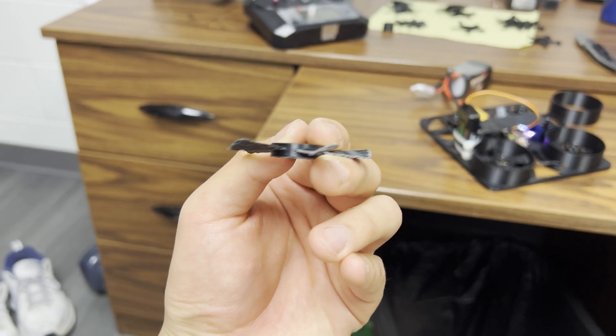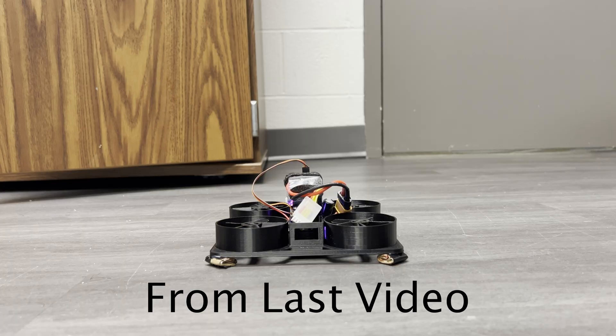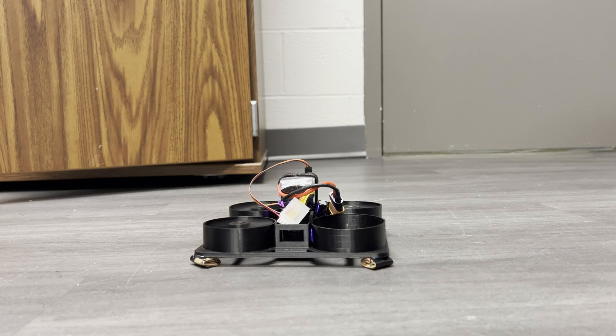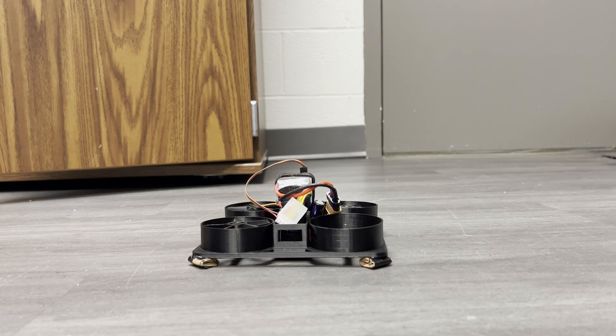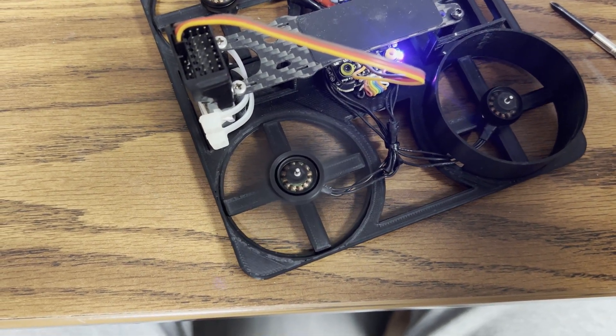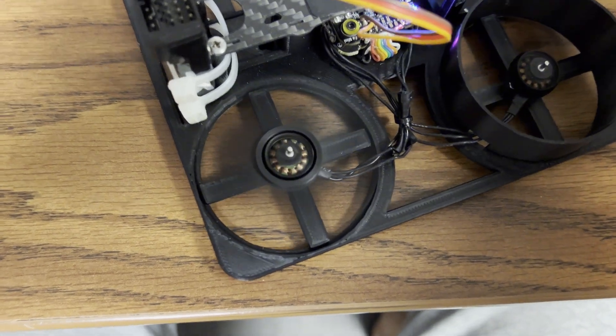In the last video, I talked about how the twisting force of the motor bore out the fan hubs pretty quickly. You can see the front left fan coming off pretty obviously, and then you can also see the back right wobble as it deforms during the test. I designed the fan to fit on the motor casing this time instead of the axle, which has proven to be a lot more sturdy at the cost of a slightly decreased fan-swept area.